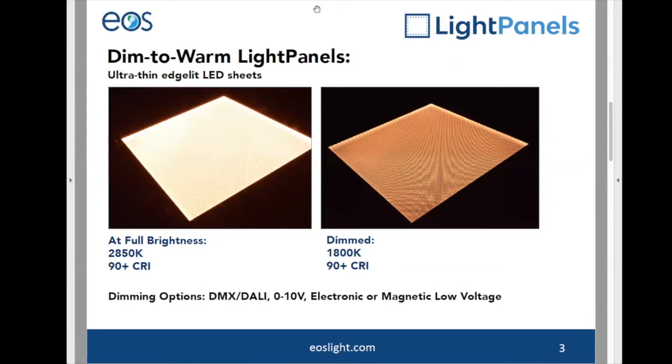They're ultra thin edge-lit LED sheets, so we can go ahead and get as low as a 1/4 inch to 1/2 inch, depending on your type of thickness needed. And then at full brightness, we're going to reach 2850 Kelvin with a 90 plus CRI. And then when it's dimmed, 1800K, 90 plus CRI.